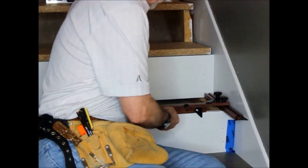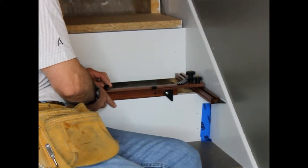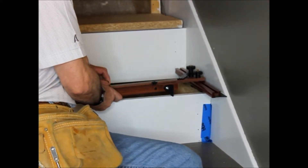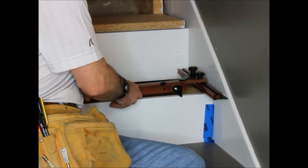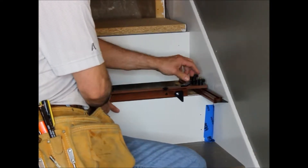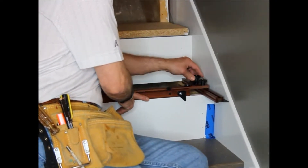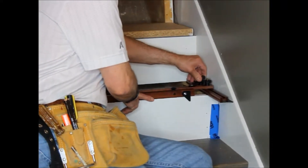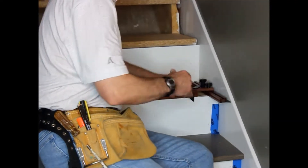You can see that it's sitting on the riser. It's got a spring-loaded stopper here, and this particular knob will enable us to move that tread jig in and out to the edge, so that we can get the proper edge there along the entire width while having it perpendicular to the riser, level with the top of the step, getting it nice and tight front and back, and then tightening that down into place. Now we've got our end measurements for the tread.